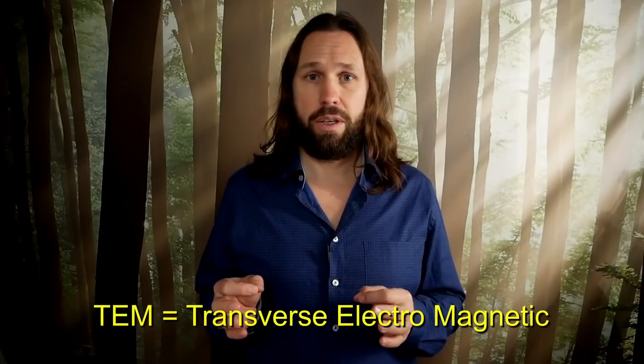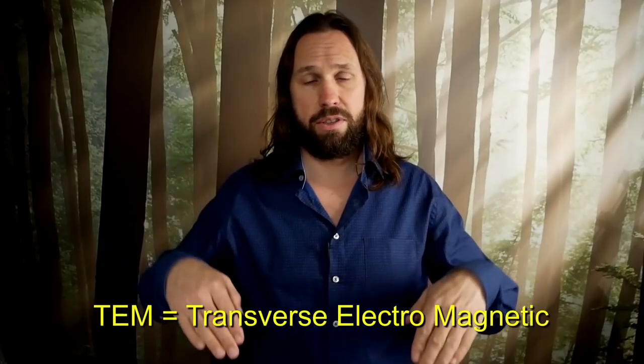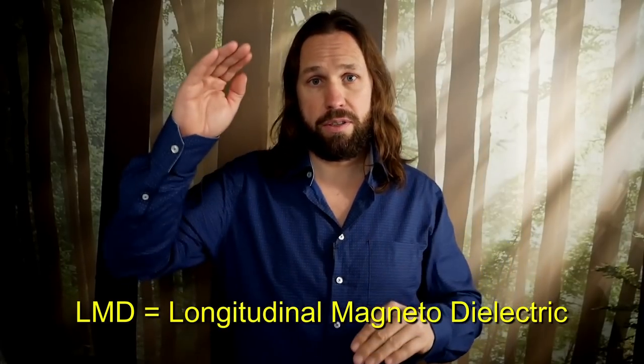As I have shown, we can recycle the magnetic field energy of the L1 pulsed coil to amplify the series resonant current of the L2 coil. Series resonant L2 can be brought into two kinds of resonance with parallel resonant L3. Hereby, L2 is the primary and L3 acts as the secondary coil. The lowest resonant frequency resonance is TEM and has L2 and L3 voltages in phase. The higher frequency resonance is LMD. Hereby, the L2 and L3 voltages are out of phase.